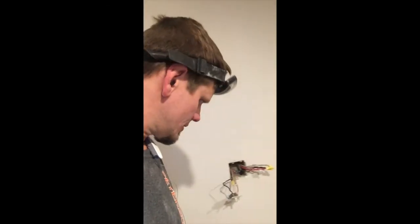It's the 6-inch. Where did my can bit go, babe? Oh, fireplace. Be careful when you drill your 6-inch hole. It's how I do it, so the mudders don't hate me so much. That arbor bit, you see that? That about 1.5 inches will go right through a bunch of wires, so be cautious. I don't know how to tell you, then you make a mistake, you just fix it.